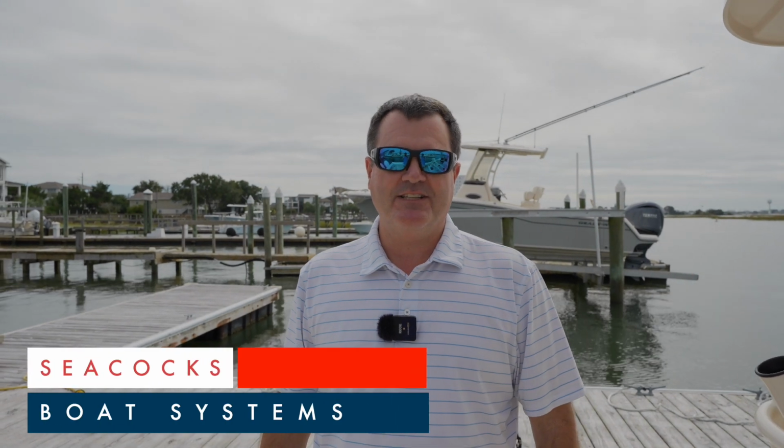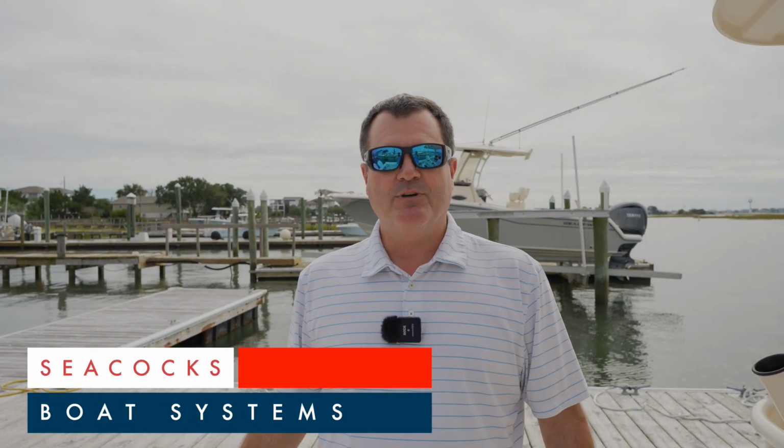Today we're going to talk about Seacocks and what they're used for. So a Seacock is basically a ball valve that allows water to come in and out. They're used for live wells, saltwater washdowns, saltwater heads. Again, you have to open and close this valve for water to come in. So for these systems to be operational, these valves have to be open.